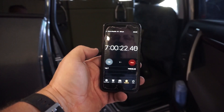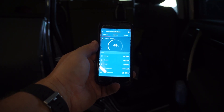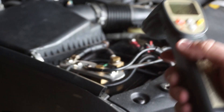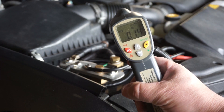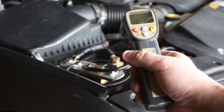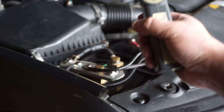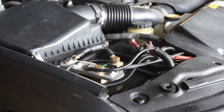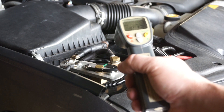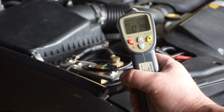Just a quick check-in: we're seven hours in and our state of charge is at 48%. It's hour number nine now, and I've been checking the battery temperature every hour since we started. It has been bang on ambient temperature. I wanted to know whether the battery actually generated any heat as it was discharging, and the answer to that question is an emphatic no.